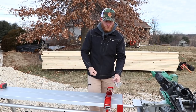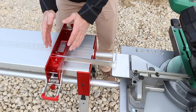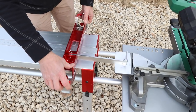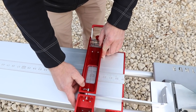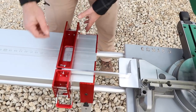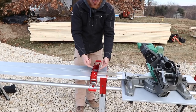This is just an attached piece that you store with the stopper, but you actually attach it this way to get into the unsafe zone close to the blade. Dave tells me he didn't engineer it to go all the way into your miter saw — that would be unsafe. So this piece allows you to cut short lengths. It's basically a 10-inch offset, so if I'm at the 24-inch mark on the ruler, I can bump my material into this guy and get a 14-inch cut. You're not going to use this anywhere past about 20 inches.